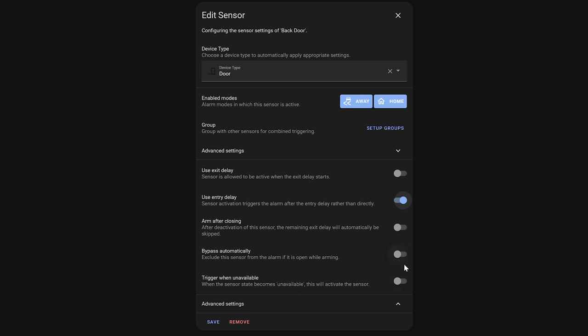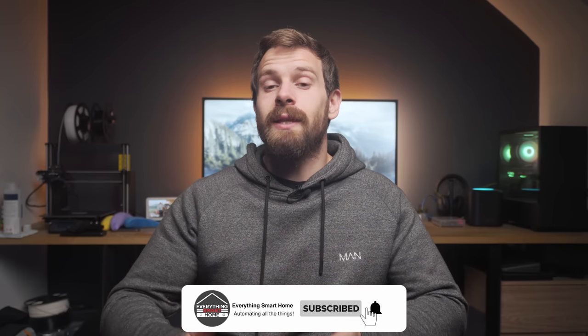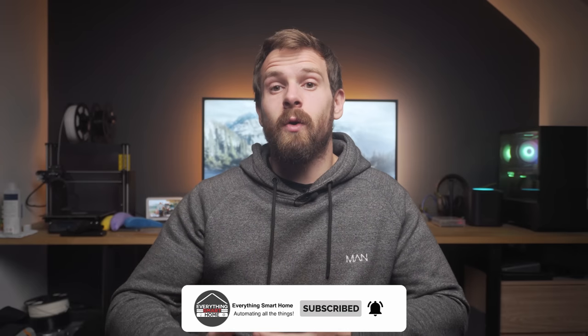You will see that you can set the device type as well as which modes the sensor is active in, like we talked about before, but you can also indicate if the sensor is used during exit or entry. So for example, if you open a door and it's not set as an entry delay, then it will cause the alarm to immediately start triggering and the siren to go off, etc. Whereas if you mark it as an entry sensor, that will then give you the 60-second period to punch in the code and disable the alarm first.